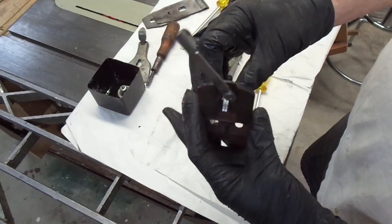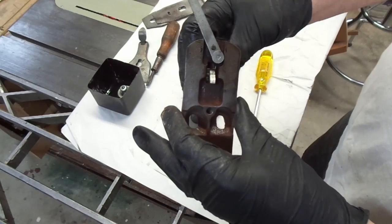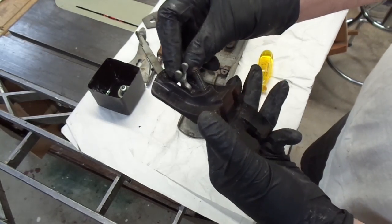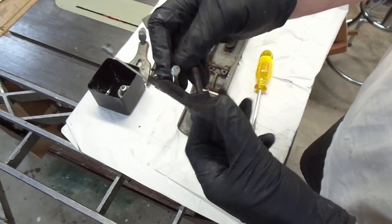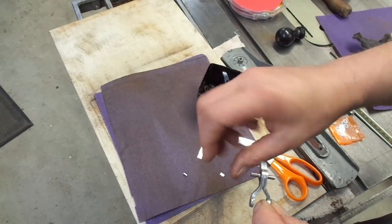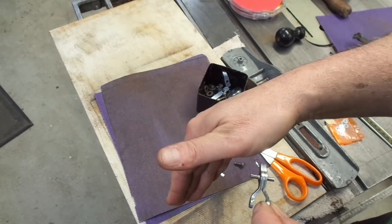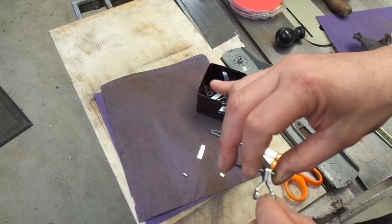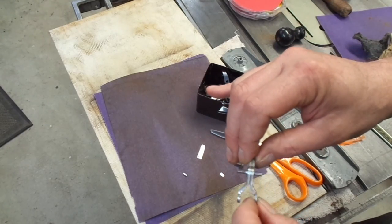There was a lot of slop between the pin and the bushing that sits in the middle of the yoke, and I've been fiddling a little bit with how to address that issue. Any slop that's in here is just going to add more play to the adjustment knob as you try to go from plunging the blade deeper to pulling it back out. So if we can get this reasonably snug, that will just make the plane perform a little better.